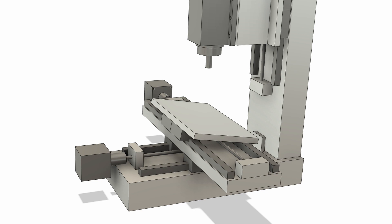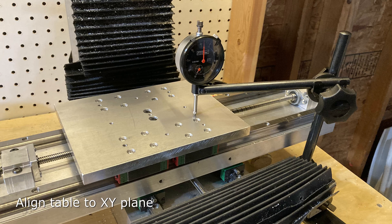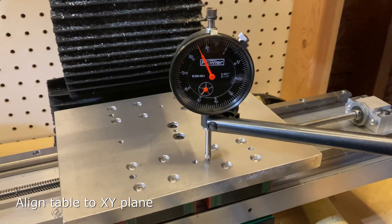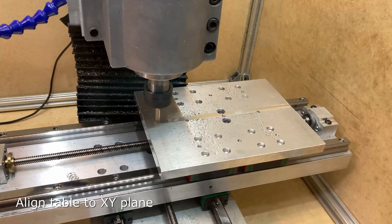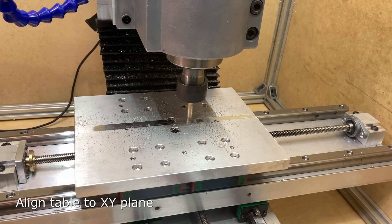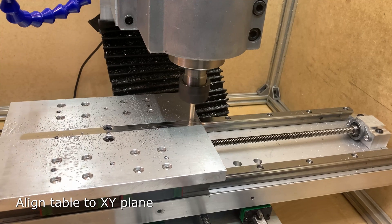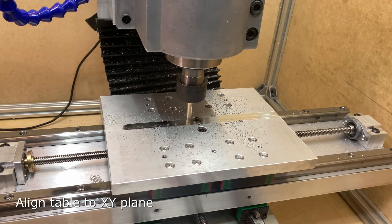The next adjustment is to make sure the table is aligned to the XY plane — you can imagine the table leaning back or leaning left or right. In my case it was surprisingly level, which surprised me because this is just the mill finish of the aluminum stock — I never actually faced it down. But although it looks good on the dial, as soon as I go further to the left it goes way down, because the platform is actually bowed. Shimming wouldn't fix a bowed surface, so I needed to make it flat first. In the process of making it flat I could also ensure it's aligned with the XY plane by just surfacing it. I used the spindle itself to cut a flat plane into the table, taking off just about five thousandths of an inch.